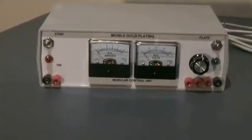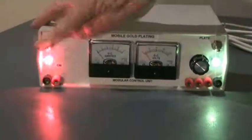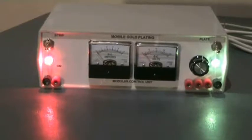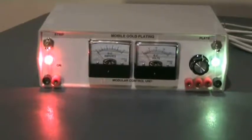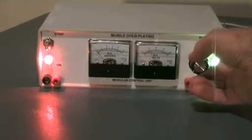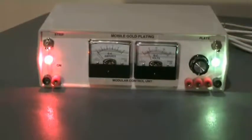The 3001 system is designed to provide completely independent plating and stripping circuits. Two different operators can be doing two different jobs with the same machine at the same time. The voltage supply for the plater is completely variable — it's not stepped in any way. It simply goes up and down as you need, depending on the solution that you're using.